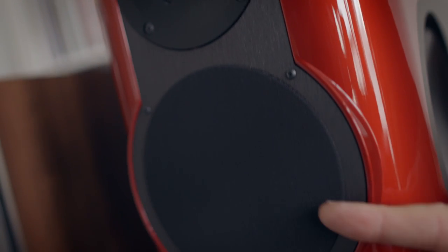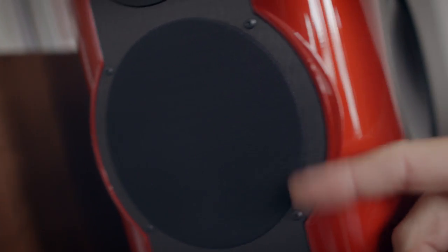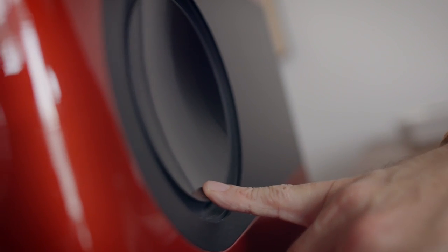With the Kii speaker, we've got tweeter, bass driver here on the front, but we also have a driver on each side. We have two on the back. So 6 drivers in total, each powered by Hypex Class D modules. So 6 amplifiers, 6 DACs. And preceding that is the crossover done in the digital domain. So within an active speaker, the crossover comes before the amplification stage.